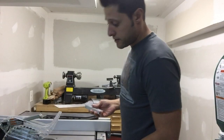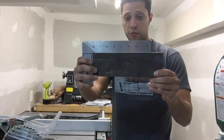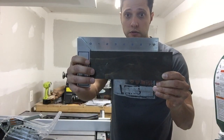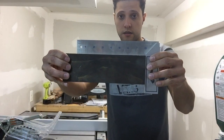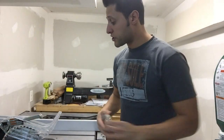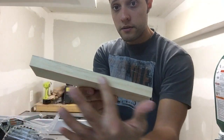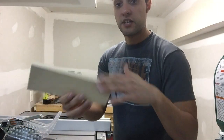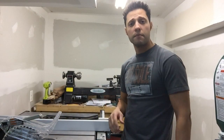Just to show you how accurate the saw is after the setup: put a square on there — absolutely no light. Check it from the other side — perfectly square. Now we know we can build some quality stuff. Saw's all set up. Also, a very smooth cut — no saw marks, nice and clean, really sharp edges. Alright guys, that's it. Hope you enjoyed this tool review. I'll see you next time.